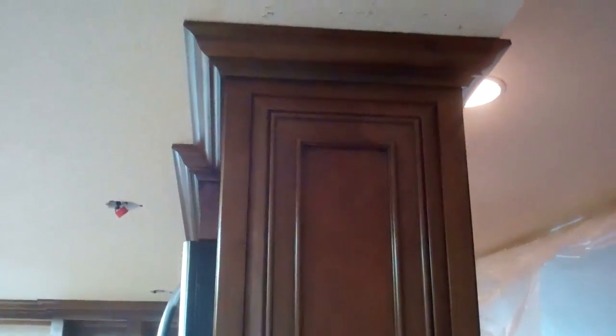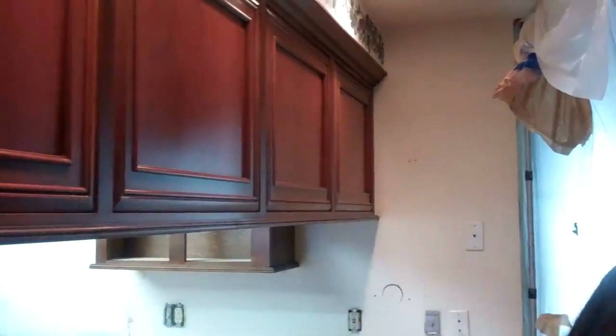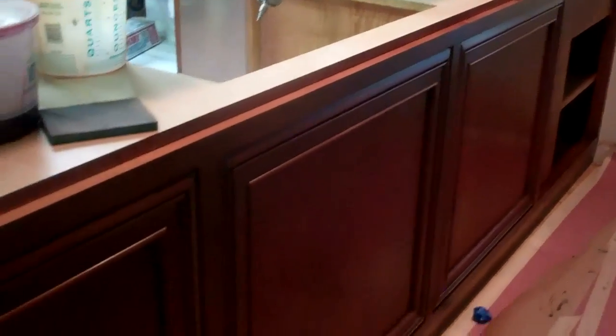We spray all the inside of that frame so that it all matches. I'll come around the side here, Keith, and show them this run here. This is the back side of a cabinet. Before it was a flat piece of plywood, and we bulldogged it and tricked it out, made it look like this. This is what you see in very high-end work, and that's what we do.